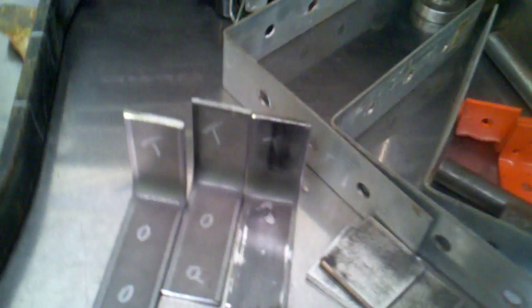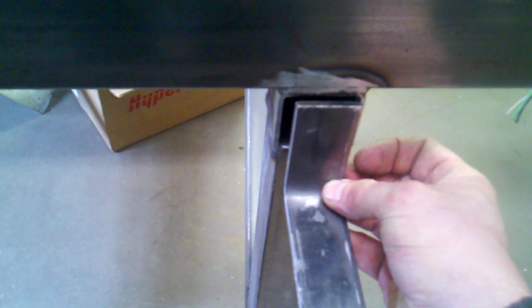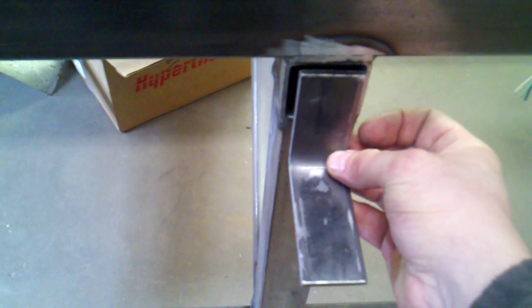Here's what I have right now - these parts are going to be welded on here with nuts welded on the back side. These brackets I bent up are going to hold the aluminum c-channel or u-channel. It'll probably stick out a little bit - maybe I'll put a spacer behind it. I'm not sure yet until I get the aluminum u-channel and measure for the cable tracking, which I'm going to get from McMaster-Carr.